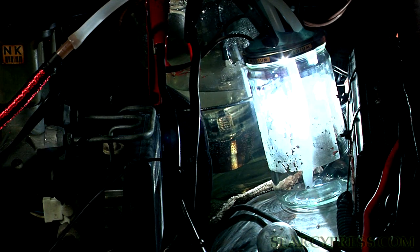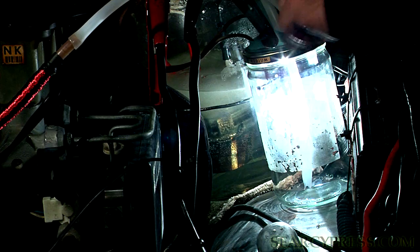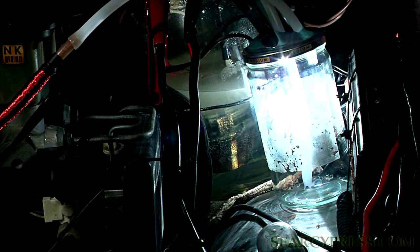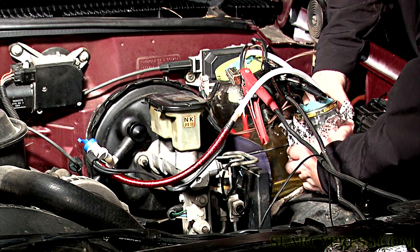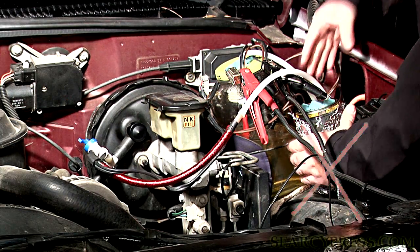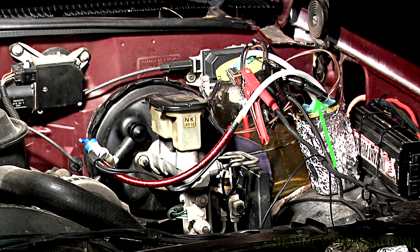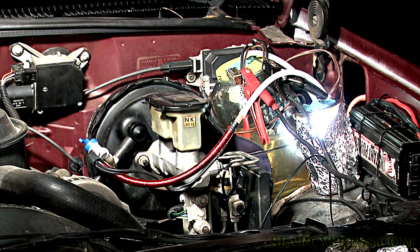You see this dryer? Looks great, right? Wrong. This dryer actually resulted in a major fire. The tube was way down in the chamber — big mistake. We found out later that it would seal off slowly and eventually clog, producing an implosion. So don't do it like this. If you decide to wrap this fuel cell and you put tinfoil on the bottom, you also have a fire. Why? Because the light is reflected from the bottom to the top of the lid, just like a car headlight — it's essentially a car headlight. So no tinfoil on the bottom. This will melt the tubes and possibly produce an explosion if you're not careful.